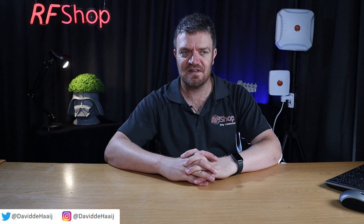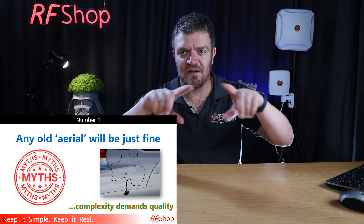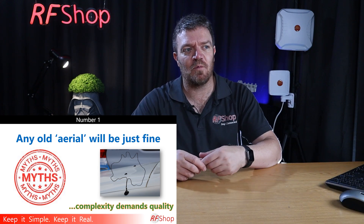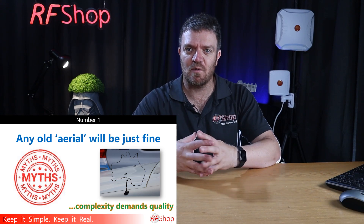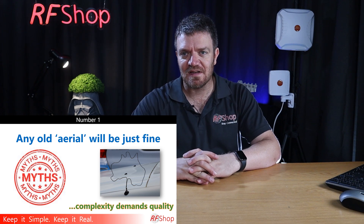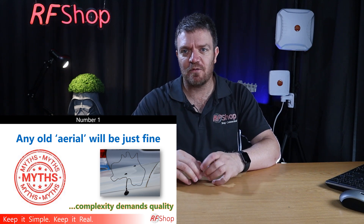If you look over my left shoulder, that's a clue — Poynting antennas are definitely in the category of brands with reputation and proven results. A photo I use in lectures shows a car with an FM radio antenna painted on — it works because the signal is so strong that even a bad antenna is enough. But that antenna would fail in rural areas where a proper antenna is needed. The same logic applies to 4G and 5G: you can get away with a bad antenna in the city, but where the antenna is actually needed, it will completely fall over.